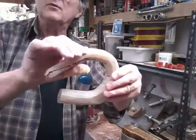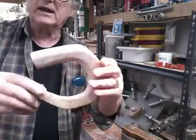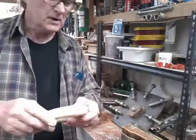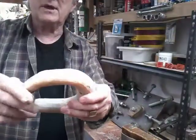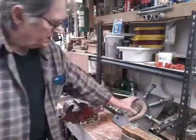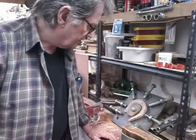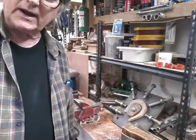What we've done is just tapered that nose a wee bit and flattened it, and what I want to do now is just heat that up again, pop it back in this little jig here and just get that shape there, because it's standing away from the former bit. So that's the next thing to do. When we've done that we'll probably do a bit more cleaning up, and we'll come back to you and show you what we've done and how it progressed.